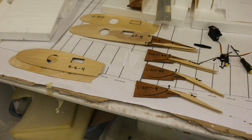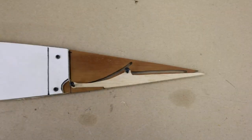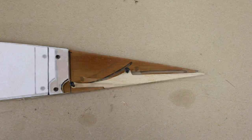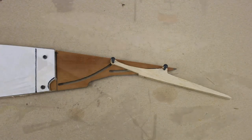I could have probably designed it for the full 40 degrees of deflection, but on a model aircraft most people don't need that — flaps can make you a worse pilot because you don't know how to retrim the plane. On the C-130 I wanted the flaps to move aft of the wing and then tilt down like the real aircraft. I ended up with about 28 degrees. I used phenolic sheet cut with a groove because wood grooves wore too fast. This shows the flaps at full deflection — about 28 to 30 degrees.